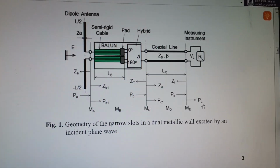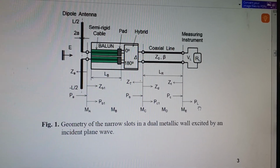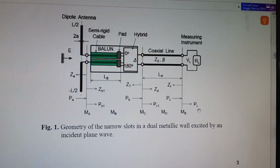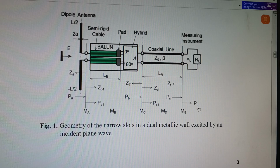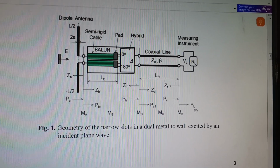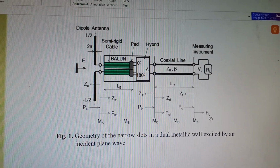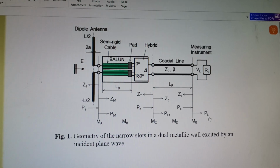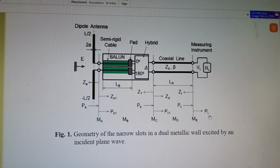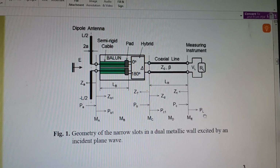So let's put an end to the myth. I've shown absolute proof here that I can make dipoles that cover the entire amateur band with essentially 1-to-1 SWR. Why can't we simply make 2 antennas for 2 bands? Or like I've done with one dipole, make it of variable length with terminals or connectors. This is real easy.